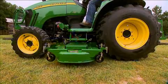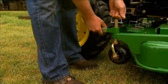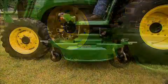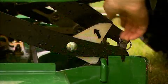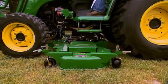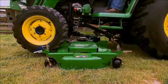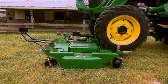Find a flat surface to store the deck, then climb off and release the gauge wheels so the deck rests firmly on the ground. Lower the mower deck all the way to the ground. Unlatch the latches on both sides of the tractor. Then, with the tractor in A range and mechanical front wheel drive engaged, slowly back the tractor off of the mower deck, keeping your wheels straight.